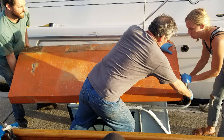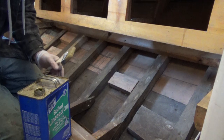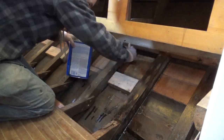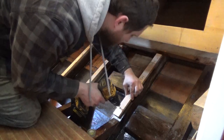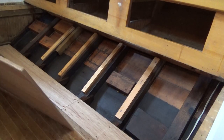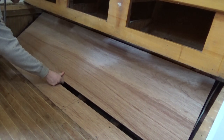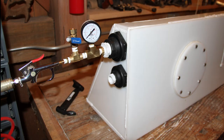The old water tanks were steel, and while they looked great on the outside with their red lead paint, cutting an inspection port revealed a severely corroded inside. I set about replacing them. I welded up the new tanks in food-grade polyethylene and pressure tested them before installation.